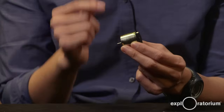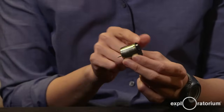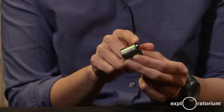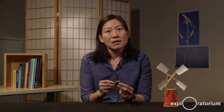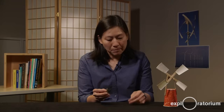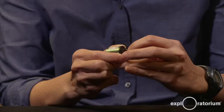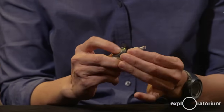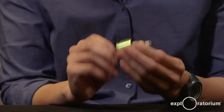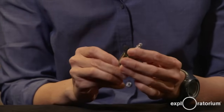The main device we're going to be using is the small hobby motor, but we're going to use the motor in reverse of how it's normally used. Normally, you attach some electrical input like a battery to these two terminals and it spins the shaft. Instead, we're going to actively spin the motor shaft and that's going to shoot electricity out of these terminals. I'm going to take an LED and attach it by threading the legs through the little holes in the terminals. And if we can find a way to spin this shaft, it can generate enough electricity to light the LED.